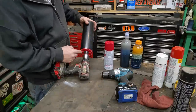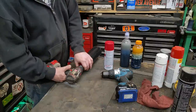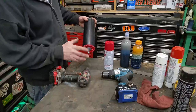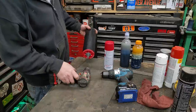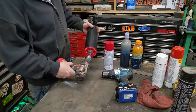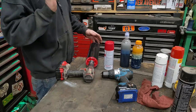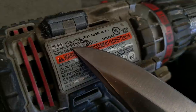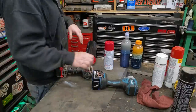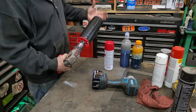A couple of things I learned: First, you want that bolt to sit as deep in the chuck as possible. I originally put a longer bolt in there thinking it'd be nicer, but I just bent the bolt — too much play. So if it doesn't seat all the way in your drill chuck, cut it off so it seats as deep as possible. Second, around 1500–1600 RPM is ideal. You really don't want to go faster than that. This drill is about 1600; my other one is around 2100, which is a little too fast at full bore. You can put the clutch on if you're nervous and it won't catch on anything.